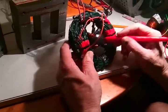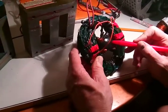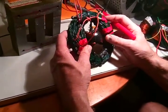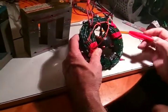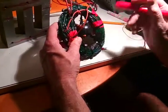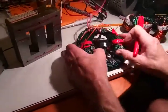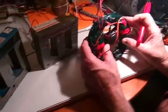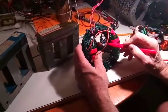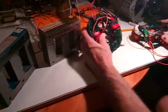As long as I have an inductive load — like a coil as the load — I can get it to be almost twice as much out as in. That's apparent power output, because I'm using a coil as a load. I'm thinking that's not such a bad thing, because if I was running a motor with this, that's what you'd have — an inductive load with an AC motor.